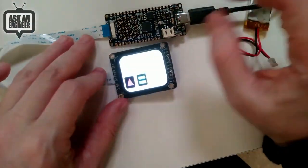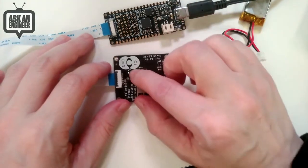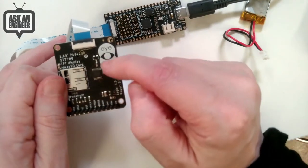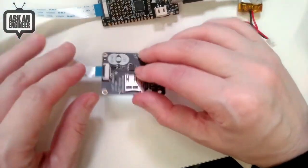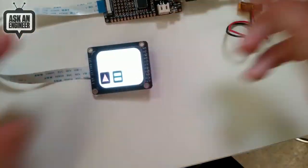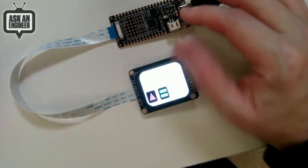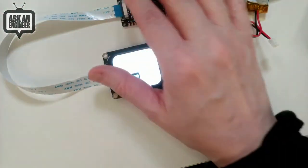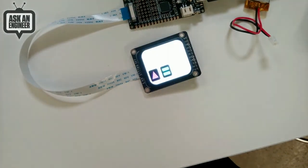It's a feather-shaped board — not quite feather — and I Spy is not quite compatible with everything either. But I Spy is this SPI connector that we're going to put on our TFT displays, and when you have a board with the same FPC connector, you can match them up and have a remotely connectable display without all the wiring you'd normally need with header pins. We have this in both 100mm and 200mm flex cable, and they're symmetric so you can use either way.